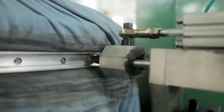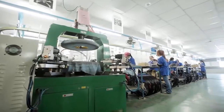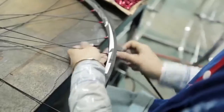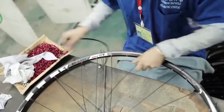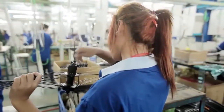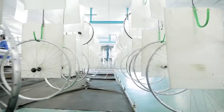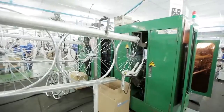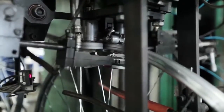The next important assembly job in the total bicycle manufacturing process is wheel building. Exodus wheels are built with the finest components, free-running bearing hubs laced with stainless steel spokes which are connected to very light yet precisely round double-wall aluminium rims. After the wheels are laced, they are massaged by machine to ensure the spokes are settled properly into the hubs and rims. This is called de-stressing.